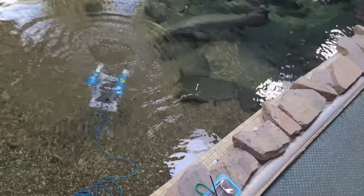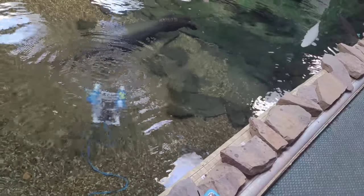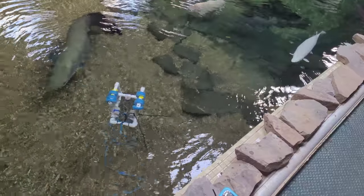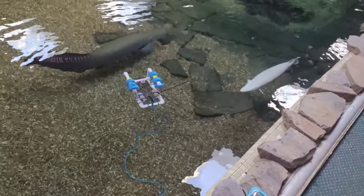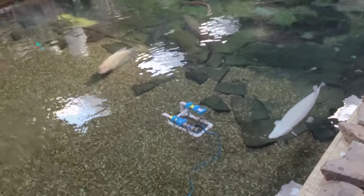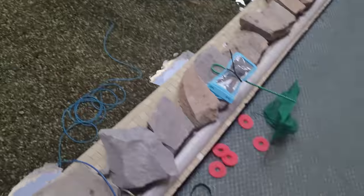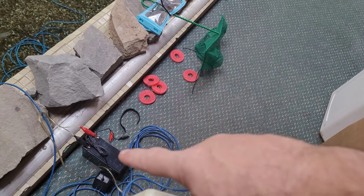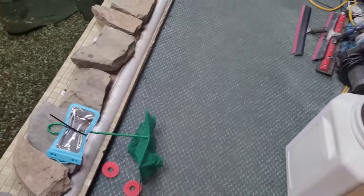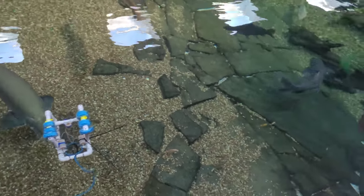Push this one and it comes up. You've got to make it neutrally buoyant — if it's down and I let off the buttons it should stay there. See how it's floating back up? It should stay at the level I put it — about halfway down it should stay there, that would be neutrally buoyant. Once I add the camera weight it's almost neutrally buoyant but sits a little front-nose-heavy, so I have to add a weight on the back. The drone has 50 feet of cable in the pool. I also need to make a belt or neck strap to carry that battery with me. This is for more flotation — that way I can have underwater drone footage and go around and check out everything.